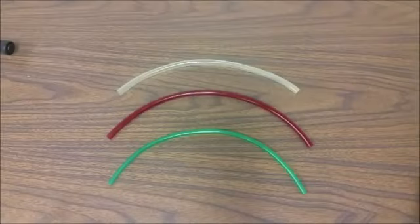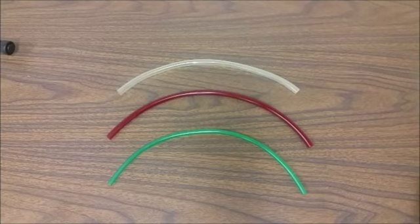This pump uses the same selection of urethane tube sets as its predecessor. The tube sets are green, red, and clear to indicate their varying size. Larger tube will offer higher throughput capability, whereas the smaller tubing will offer higher resolution. The selection of tubing should be made depending on the operator's specific application.